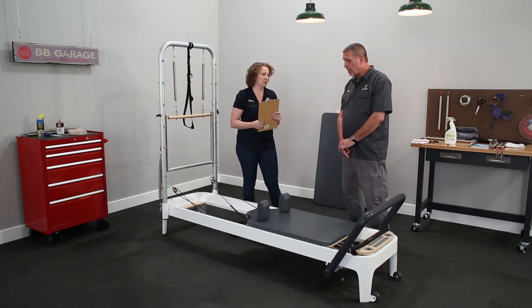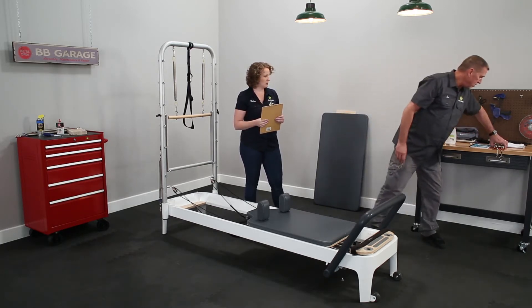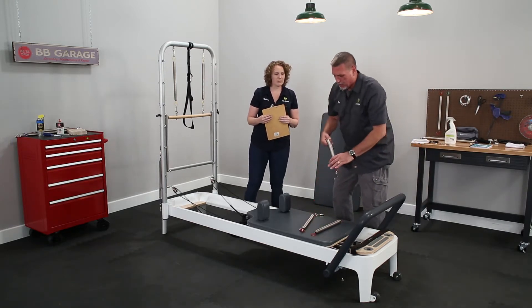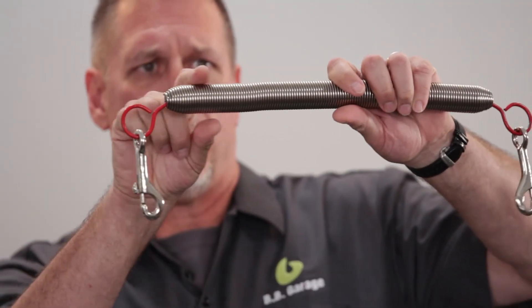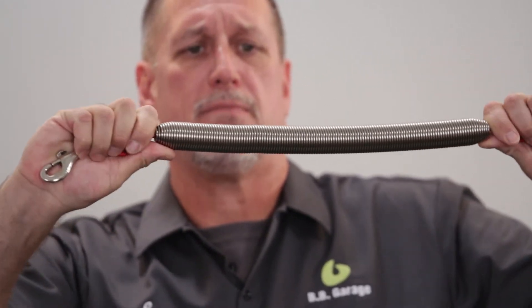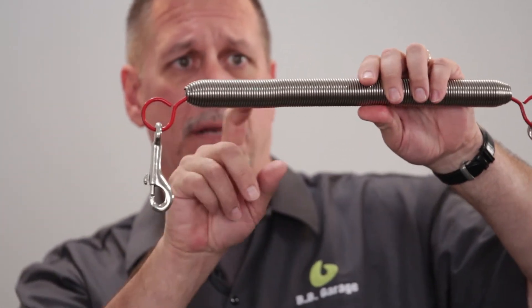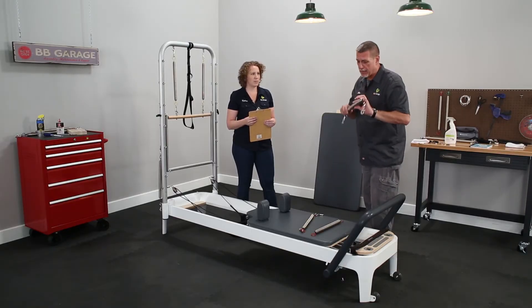Monthly, we definitely want to check our springs for typical issues. The first example is a subtle one: an offset in the coils — there's a little dip, a drop. It's caused by a spring being extended and snapping back hard. It's going to be a weak point and there's a good chance the spring will break in the near future, so I recommend replacing it.